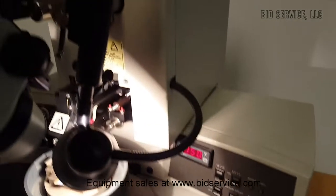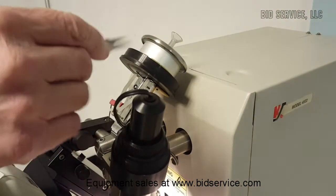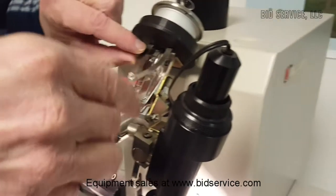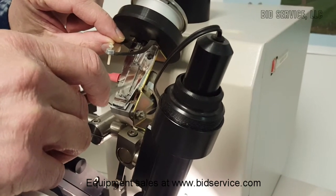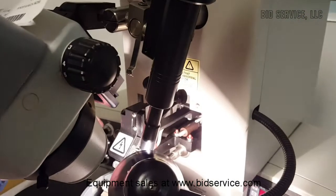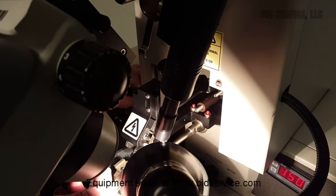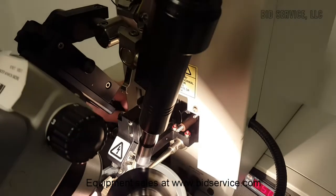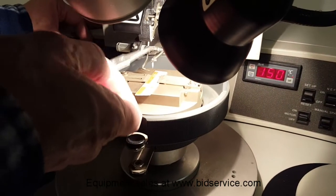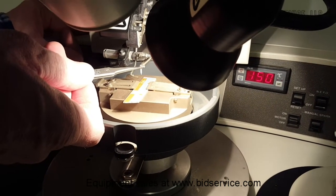Up here we have a two-inch spool of gold wire — this is ball bonding wire. It's fed through the feed tube down through the feed tube. There's a glass slide that can be removed; it'll go underneath the glass slide, through this eyelet, and then down through the drag clamp. You need to open the drag clamp and put it between the two eyelets and the two glass plates. The drag clamp is used to seat the ball up into the tool after the ball is formed on your first bond. Then you have your wire clamps that are open, and you'll go down through your capillary.